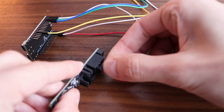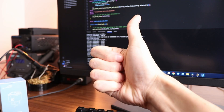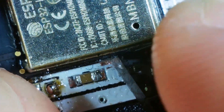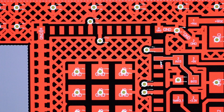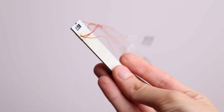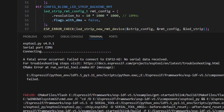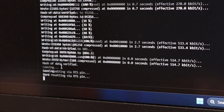To access UART pins of the chip on my custom board I had to do some modifications — cut some traces, remove some components — because initially I was not planning to use UART and not all the pins were easily accessible. But luckily I managed to connect the programming wires. And the moment of truth: let's try flashing it. And it doesn't work. So it must be a hardware problem. Eventually, after cutting more unnecessary traces, soldering some pull-up resistors, soldering one more board and resoldering chips again, I finally saw some signs of life. Easy. Told you, I'm a professional.